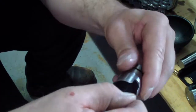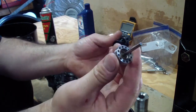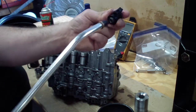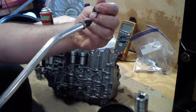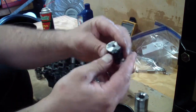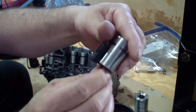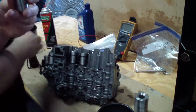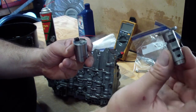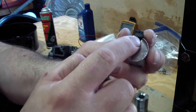It's all rounded and clean. Okay, once again we make sure the brass washer is inside and everything is clean — we blow it with air, it's all clean. The body is also clean. There was a lot of material — metal shavings and disc material — came out of it. Same thing, that little line over here is going to line up with this part over here.